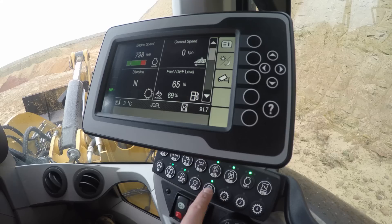With the intelligent hi-stat powertrain in the M-Series Small Wheelers, you can safely shift between range 1, 2, 3, and 4 on the go. You can shift up or shift down without risk of any damage, because we simply increase or decrease the amount of flow that we send to the hi-stat. Let's put that into application starting with range 1 and on to roading.